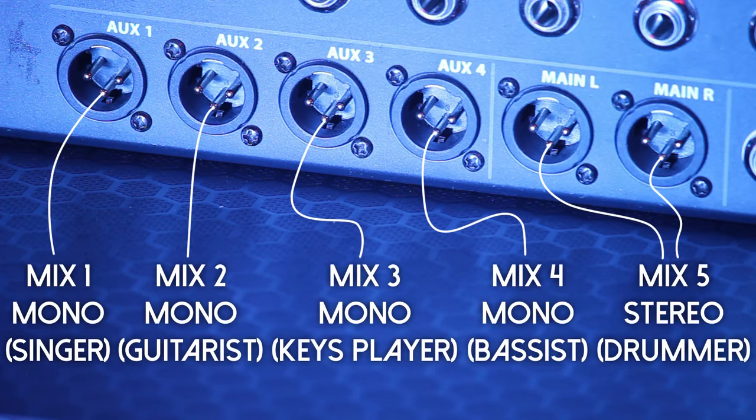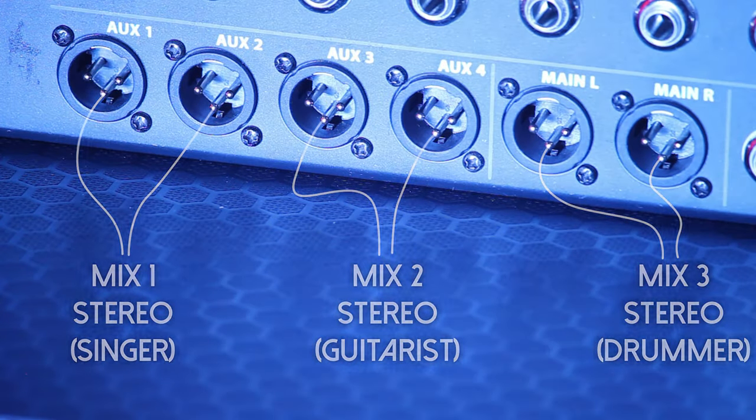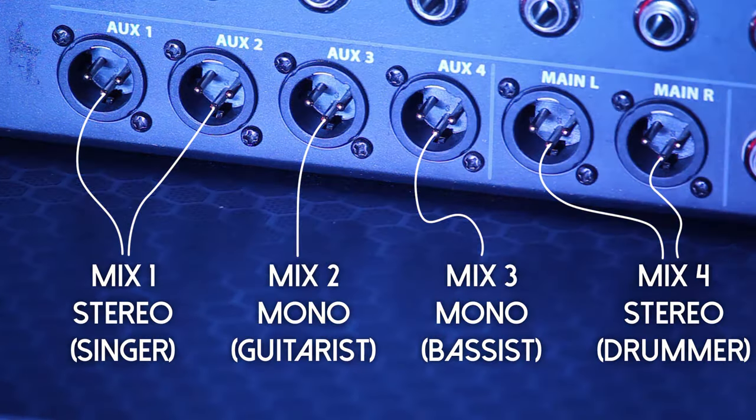It has 16 inputs, four mono outs as well as a stereo out. You can set it up in a variety of ways — for example, a band with five members might use four mono mixes as well as a fifth stereo mix. You can also set it up as three stereo mixes, or two stereo mixes and two mono mixes. There are other mixers that can support more inputs and more outputs — the Behringer X-32 rack, for example, which a lot of bands use, coupled with an S16 Stagebox can take 32 inputs and do 16 outputs, meaning you can get eight stereo mixes.